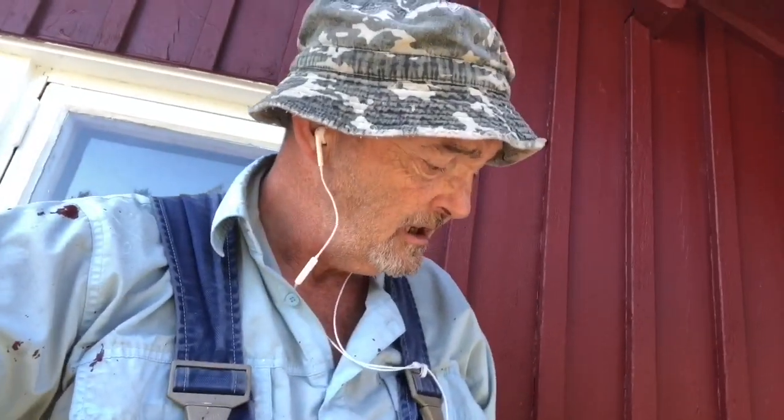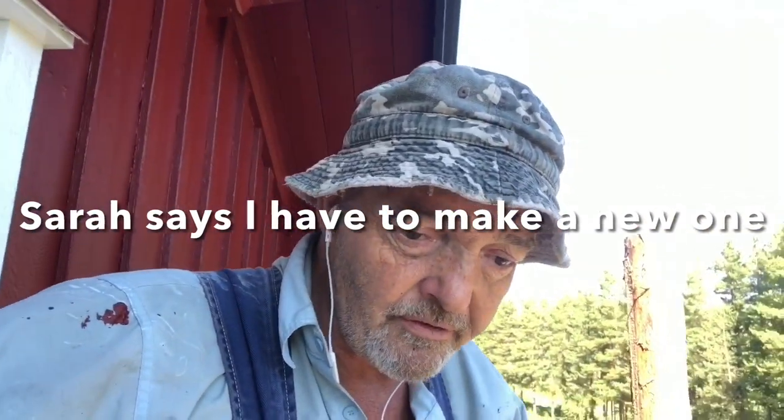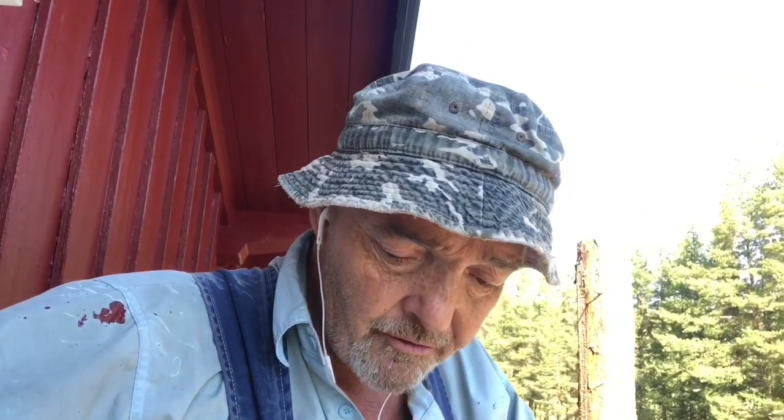So I think now it's time to remove this entire top layer. And the reason I'm going to take this down in sections is the snow loading. If I take this lift off, that'll be another load of weight that's off of the uprights. So not only do I not need to get up here again, I'm still contemplating on this window. Anyway, not this year. So I'm going to take this entire top lift off down, and the rest of the scaffolding will stay through the winter because I want to make some alterations down there, but I'll probably paint all the way down to the next lift.